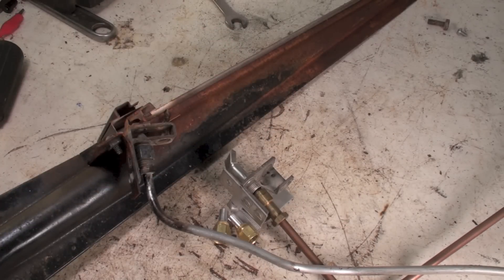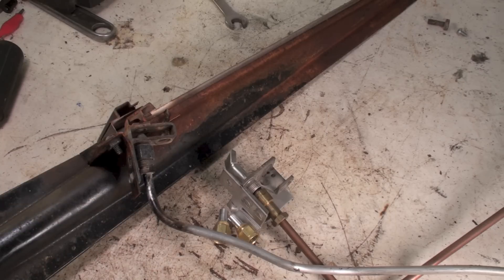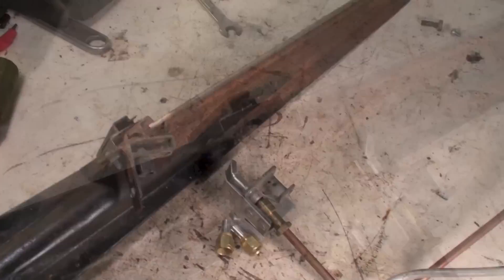Because the pilot is a very small light, we want to have some sort of restriction in there, since there's no real restriction in the gas valve itself. There's a pilot adjust, but it's not very accurate, so we use these little pilot orifices. Now I'm going to take this one off so you can see it.